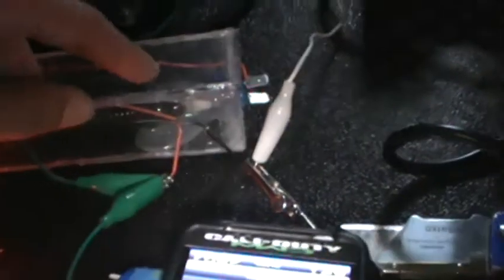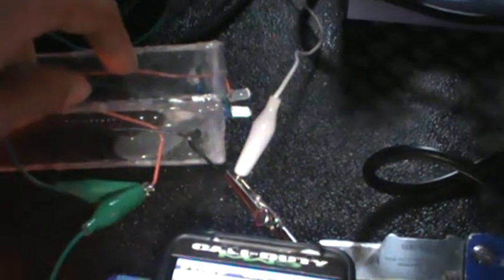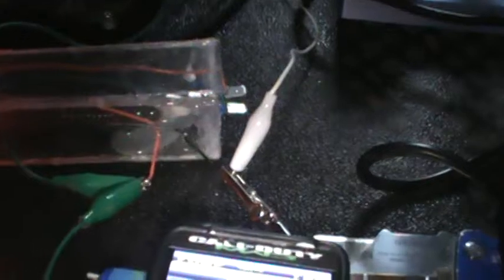It's shut off. I don't know. Hold on. Oh, I know why. Because I have the diode on there. I'm sorry. Hold on 1 second. I gotta take the diode off real quick, because the diode's coming from this power supply going straight into the battery, and it's not gonna release any of the power into here until I take that diode off and flip it the other way. So instead of coming into the battery, it's going out of the battery instead. So it'll go into here instead.